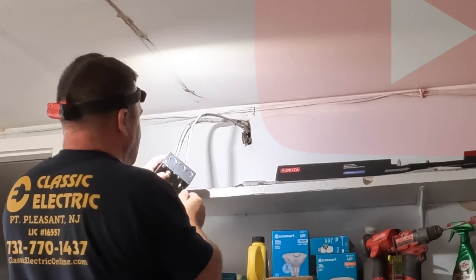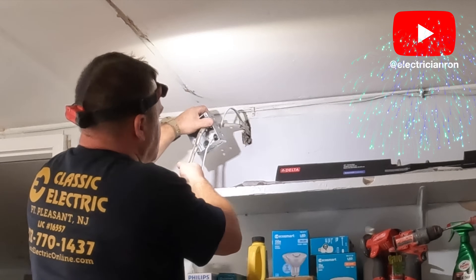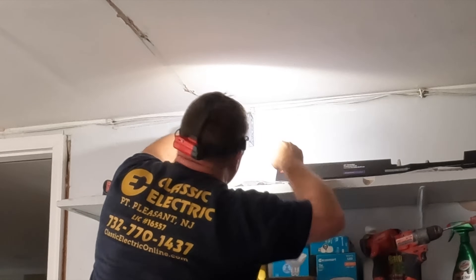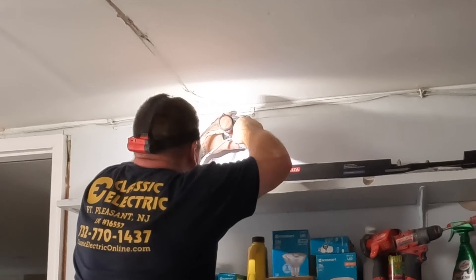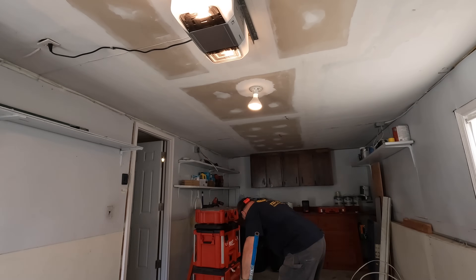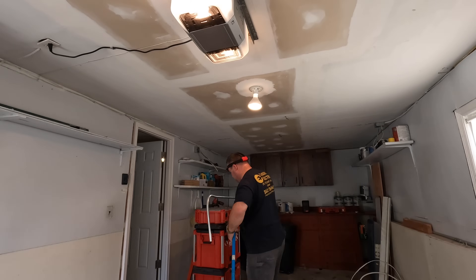On this day I didn't have my multi-tool — the oscillating tool — otherwise I would have used it to cut away this paneling finish over the sheetrock in the garage. I just wanted to make the hole a little bit larger so I could have two different connectors attached to the back of the box to bring my conductors through. There's not enough room in one connector for both the 10-3 and the 14-2. I used a paddle bit to make the hole just big enough to fit the connectors.